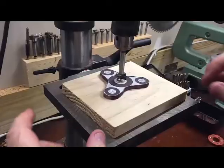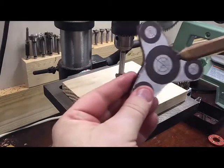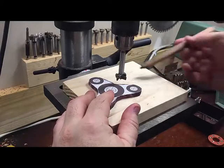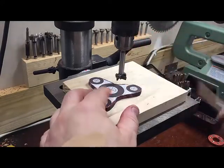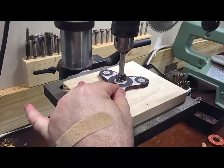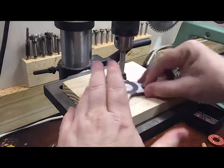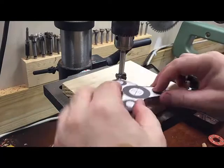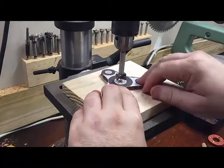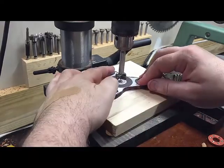In the center is a crosshairs reticle, and at the bottom of this there's a little brad point tip. We're going to align that tip with the center of that circle right there, tap it to make sure you get it in the center. What I did was leave a little indentation - it makes it easier to find it - and then you drop down. Now we know that this is in the center, so we're just going to hold this down and drill it out.